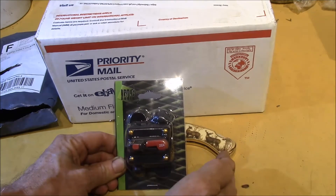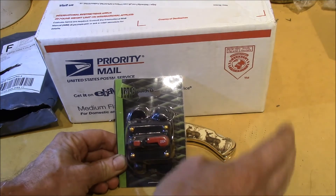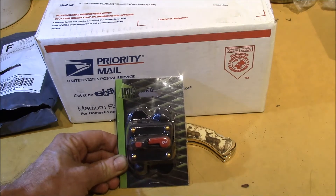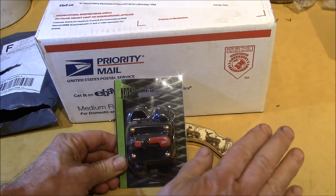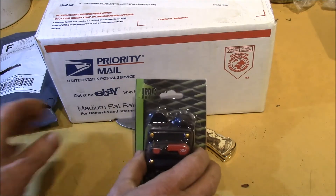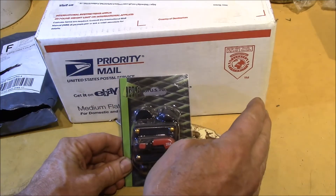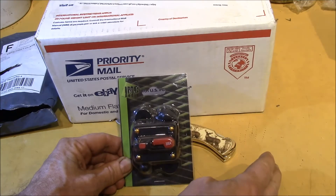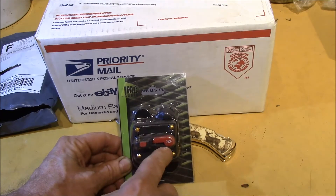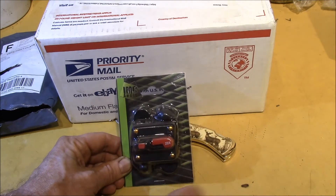On the positive side will be the circuit breaker. Then on the other side will be the super capacitor, the inverter — which has an internal 200 amp fuse — so all the loads will be on this side and all the batteries on the other side. The charge controller will come in, and I've got a 70 or 80 amp breaker for the charge controller.